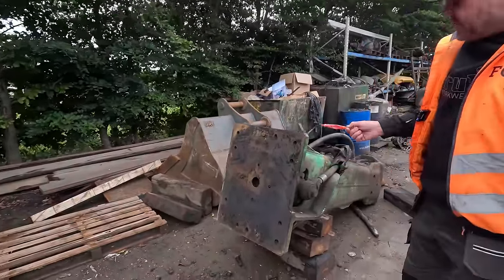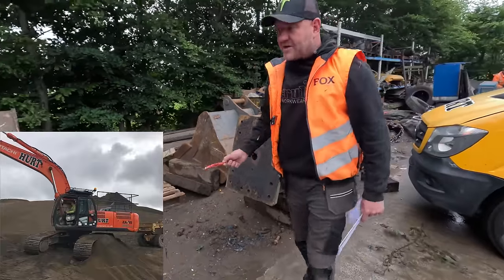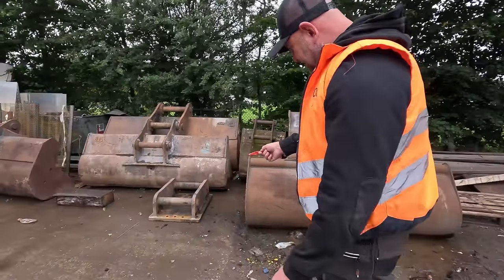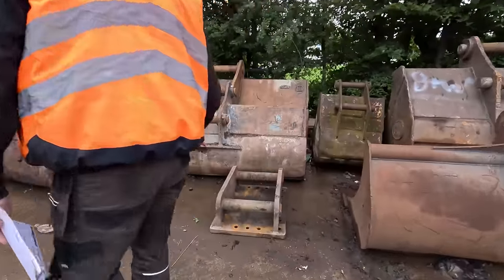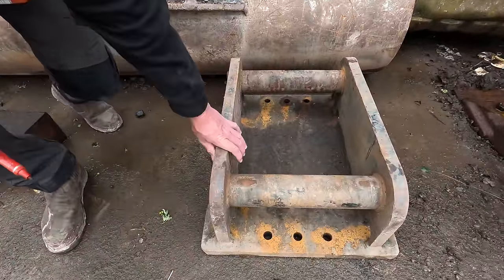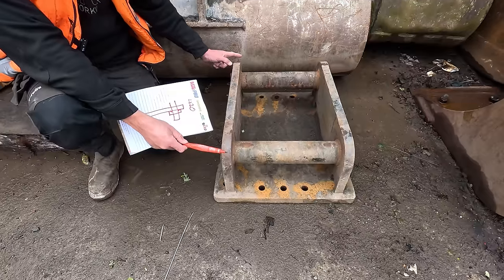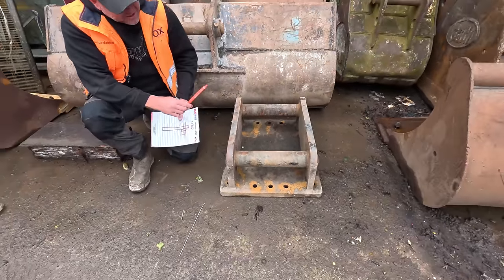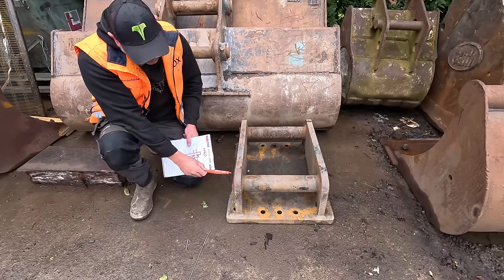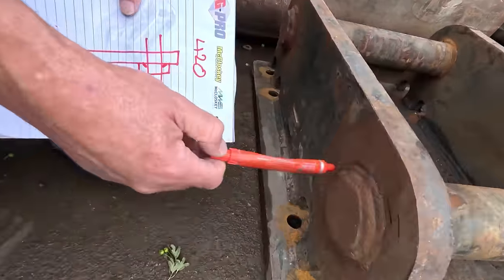Now then, we're putting that on a 35 ton excavator now, so we're putting it on a ZX350. It was on a ZX300, which had a different cradle on it, which is there. So this cradle won't fit the 350, yeah? For starters, it's on 90 mil pins and it'll be at different centres, right? When I mentioned talking then about putting the collars over the end of the pins, this cracked a couple of times, yeah? It's been welded a few times.